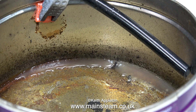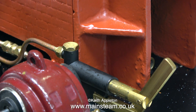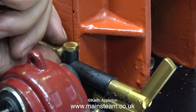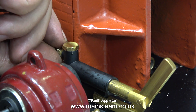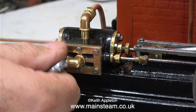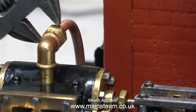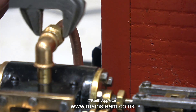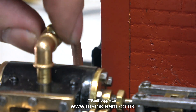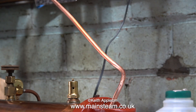The chimney condenser is successful — here's the condensate that's come out of the drain pipe. I left the boiler to cool for a little while and then started to remove the piping; all of it needs to go in the acid bath. The acid will clean off the oxidisation both on the inside and outside of the pipes. Some of the pipes are going to be polished and others are going to be clad in string. The exhaust pipe will be polished, but the steam inlet pipes will be clad in string because they get very hot.